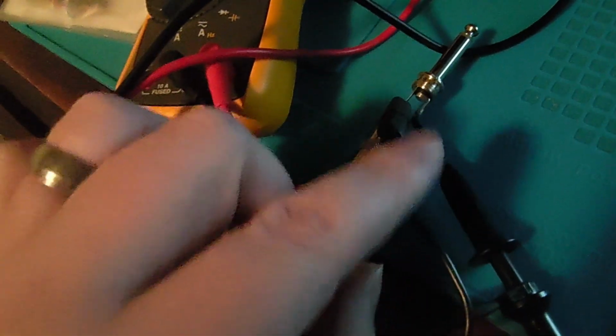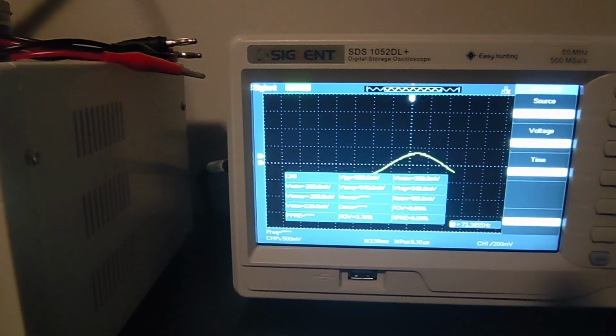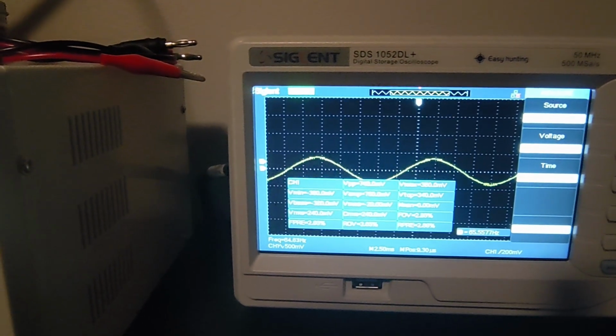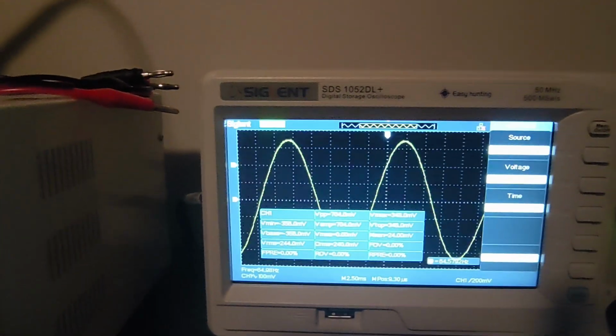Got the sleeve pulled back, going to the scope probe set to 1x, and then get it up here on the oscope itself. All right. So let me turn down my volts per division a bit. I think right there will be good. And we will double check. Bass is set to 0. Okay.